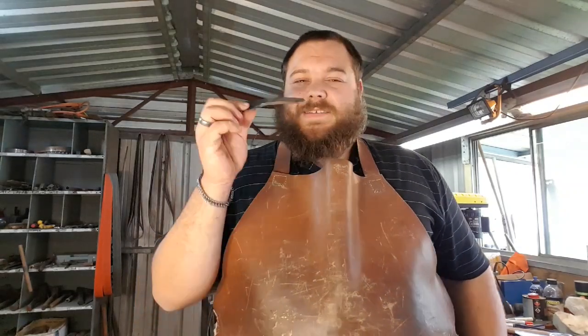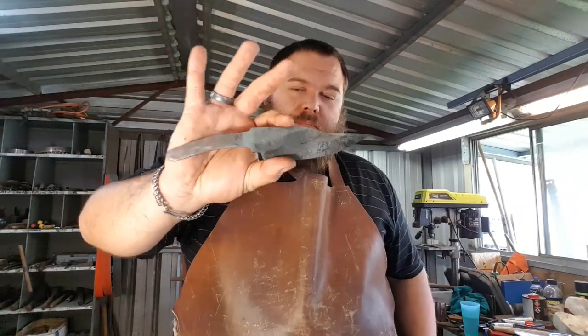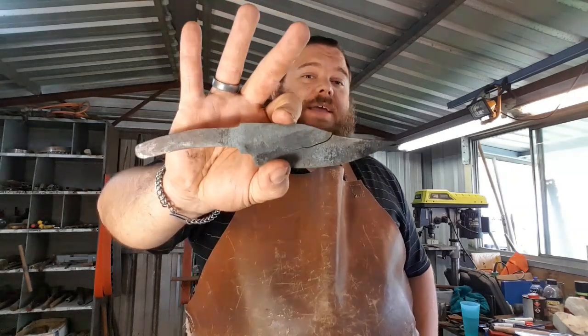Having a soft spine and a hard edge is an important thing on a knife, especially one that's going to undergo a lot of strain. But partial quenching like this is incredibly dangerous to the blade. I'm now going to show you the third method, which is almost exactly the same as this but is a mix of edge quenching and full quenching - called partial heat quenching. In this case I'm going to be using my charcoal forge, but you could use an oxy-LPG or oxy-acetylene torch. It resolves some of the issues with this steel. This is what can happen, especially with strong quenches like water and brine, on large high-carbon steel - about 0.95 carbon - when you've got full heat.